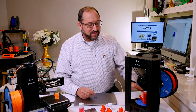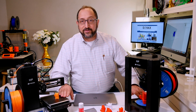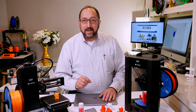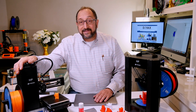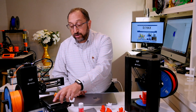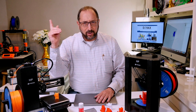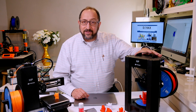The challenge is that things will not stick to the print bed — to the surface that the prints reside on. The reason is that the distance between the nozzle and the print bed may not be optimal because every printer is a little bit different. Now on the Select Mini, if you need to re-level your print bed, you do it by adjusting these four screws. They're very easy to get to, and I have a number of videos on the channel that teach you how to do that.